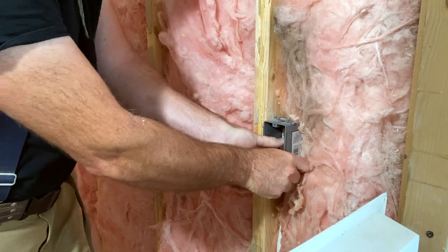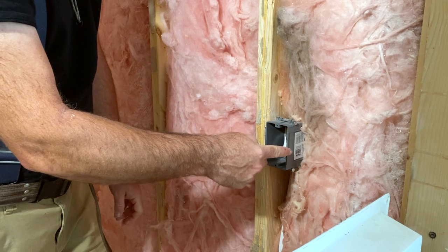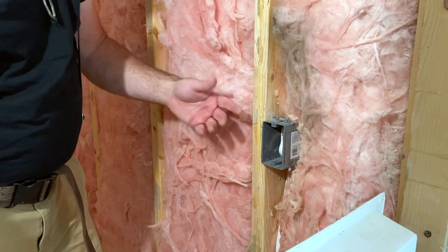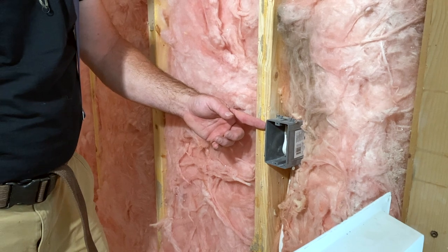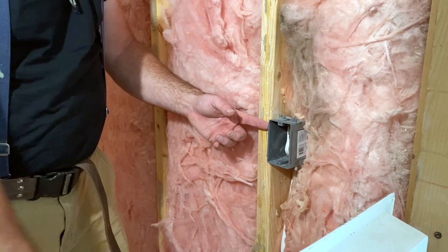In preparation for the drywall installation, we don't want this wire sticking out in our way, so we'll go ahead and fold it back up inside the box. Try to keep the wires away from the edge of the inside of the box — this is kind of where the roto-zip will start. Then we'll pull it out and go to the outside edge and cut around the outside. You can't see it from here, but there are two little notches on the outside of the box that help you align it with the stud so you can get the half-inch depth you need for the drywall.